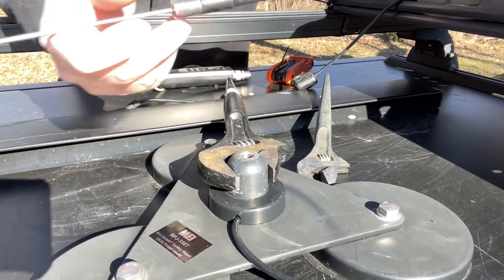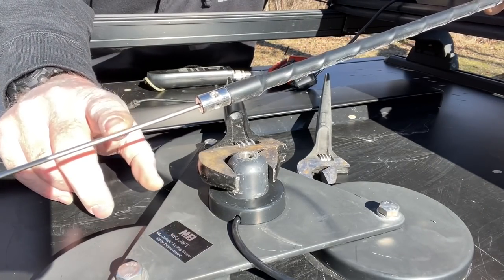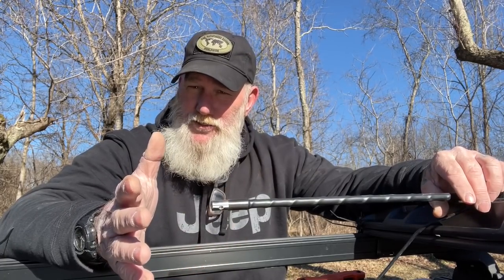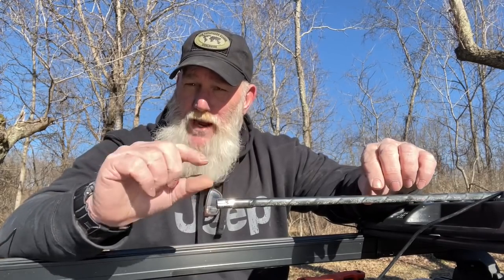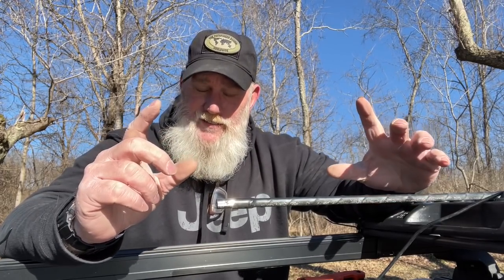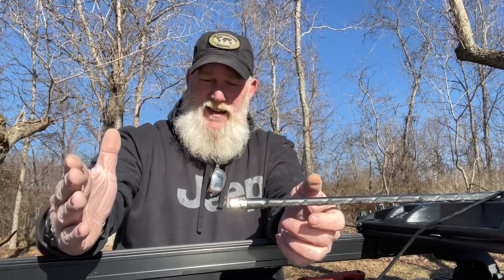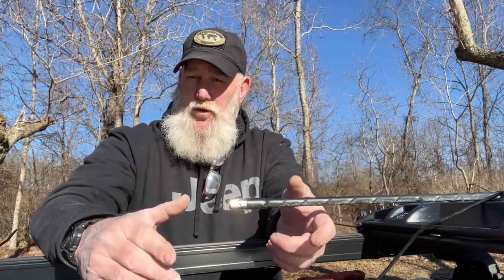What we're going to do is take this antenna and loosen these two set screws, and we're going to adjust it in and out to check our SWR. When you buy these antennas — I buy the mount and antennas from DX Engineering, a local company here in Ohio that sells all types of ham radio gear. When you buy these Shark sticks, it comes with a piece of paper that gives you recommendations for the length that the adjustable portion of the antenna should be from the ferrule to the tip. That gives you a starting point of where to adjust from — that's what we're going to do, start there and see what we come up with.